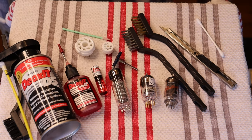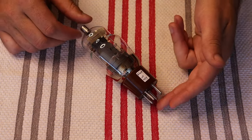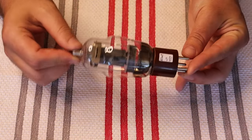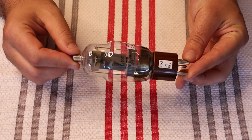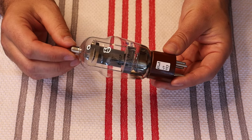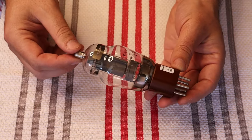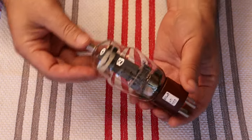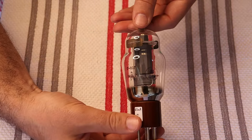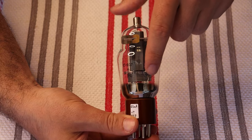What did you get in this week? We were lucky enough to find a partial case of these absolutely beautiful 807 tubes. These are beam powered tetrodes — kind of like the classic power transmitting tube, but also used in a lot of hi-fi systems. This is kind of like a 6L6 with a top cap in its specs and its usage. These are beautiful examples from 1978.